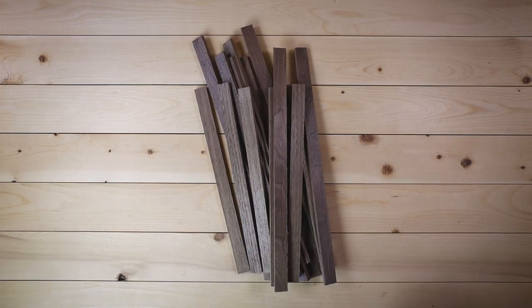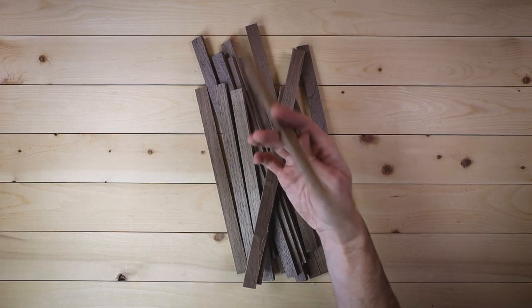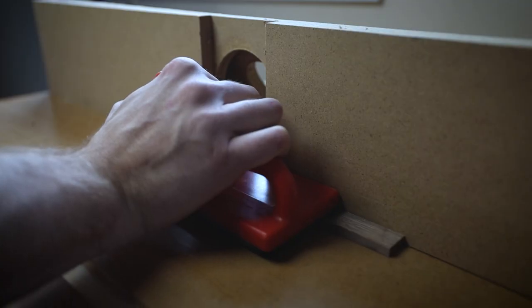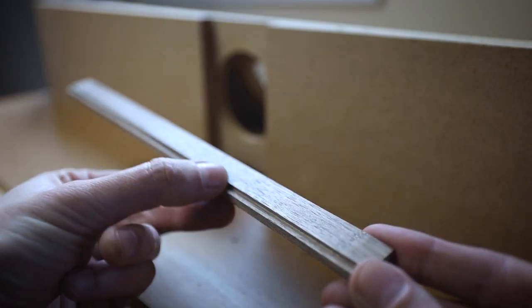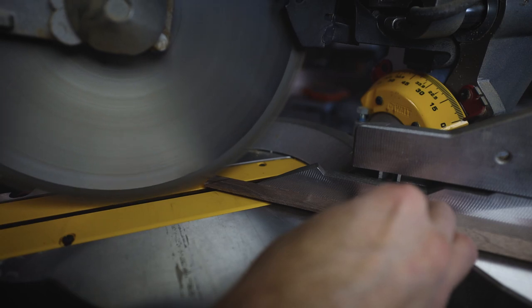I made up a bunch of smaller pieces so I can make a sort of frame on the front of each panel, into which I can slide resources in and out as needed. I'm taking each piece for a pass on the router table — the frames are going to be permanently attached so I need to make a groove that the papers can slide into. Once that's done, I set my chop saw to 45 degrees and cut a miter on both ends of each piece.